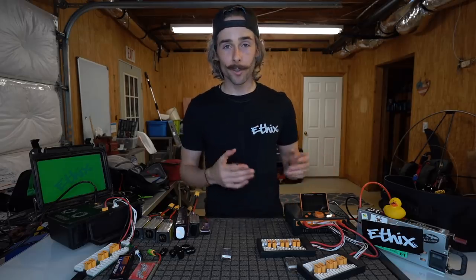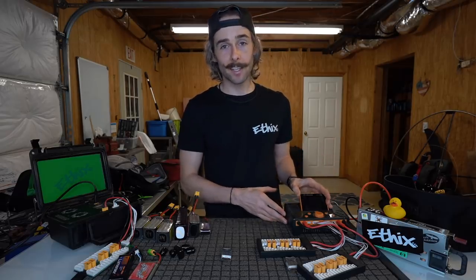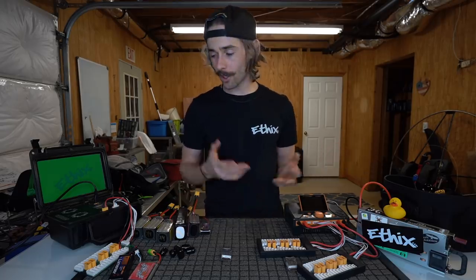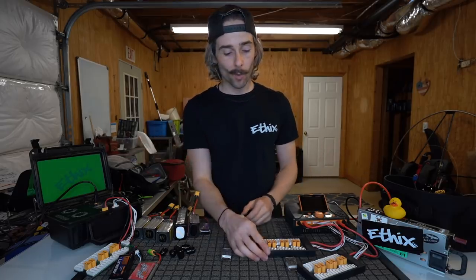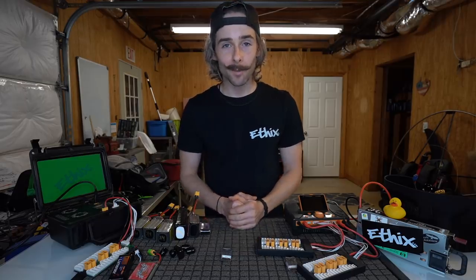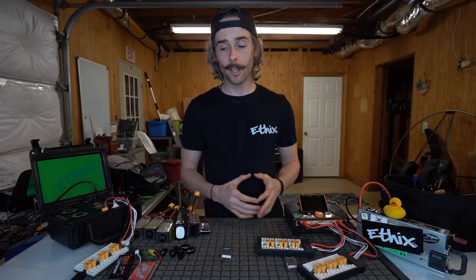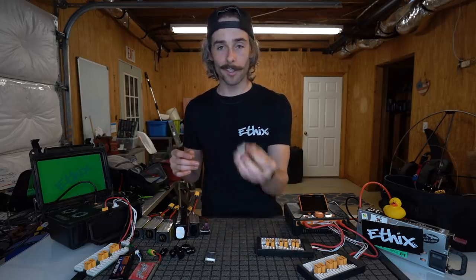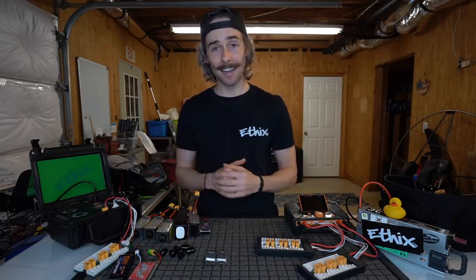Also, we'll talk about C ratings. Can you charge at multiple C to get batteries charged faster? What power supplies and what chargers you could possibly use, and what a balance board is good at, and why you might not use parallel charging or something like that. Also talk about some battery checkers as well, which are super cheap and they save lives, okay?